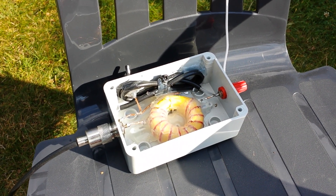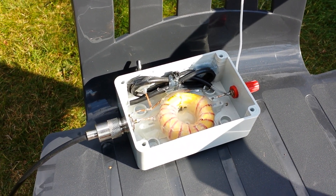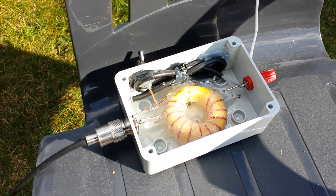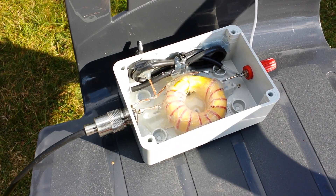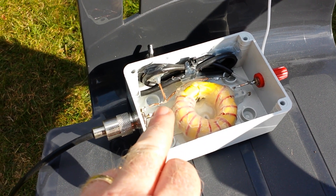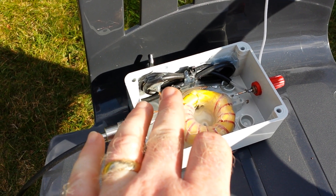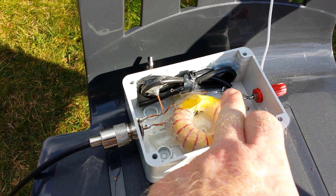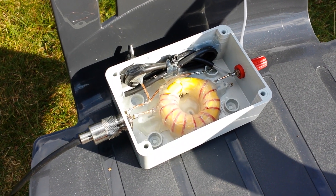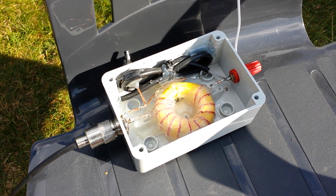It's been set up on the bench for a good resistive match. What we've done is put a resistor across the output tails, treating a 2k7 resistor as our dummy load on the analyzer. We've moved the coils around until we got a nice 50 ohm impedance, got rid of the inductance, and the capacitor is effectively nothing more than a piece of RG58 that goes across the ground to the antenna. The core is a T200-6 — I think we've got 13 or 14 turns total on there before we got happy results, and very good results.